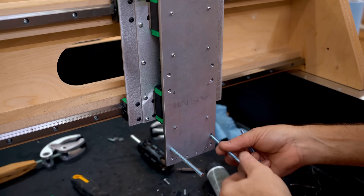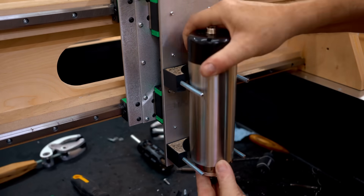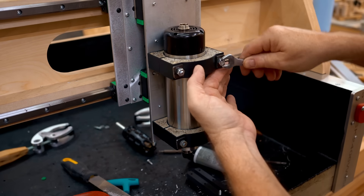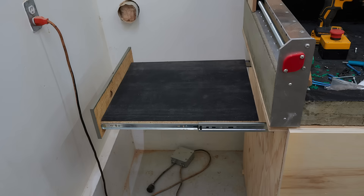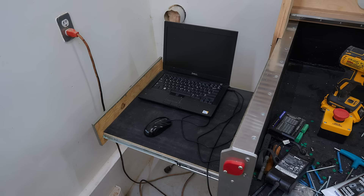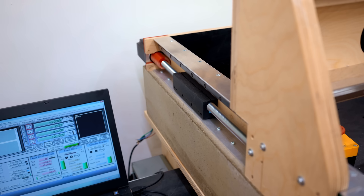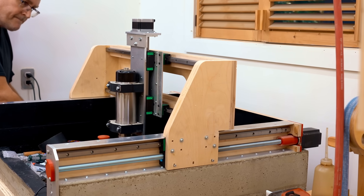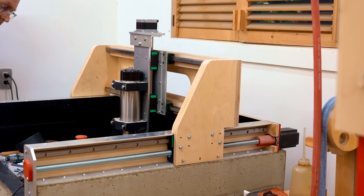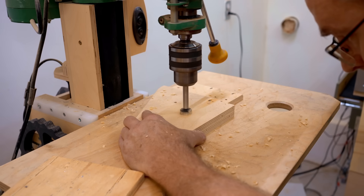The quarter inch threaded rods I'm putting in here are for the spindle clamps. I get those threaded in, get the clamps put on, and get the spindle put on as well. With that done I built a very crude stand for the CNC so I can move it off the workbench and get it into the place where I'll be using it — I didn't film it, and it's not my best work, but it gets the job done and has a tray that slides out on the side for the laptop that will control the machine. With the CNC in a more permanent location I could hook it up and try it for the first time, at least to drive the y-axis. It's always nice to see that the machine actually works after you've put so much time into building it, but of course I'm not done yet.